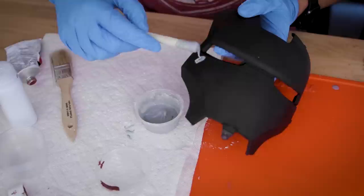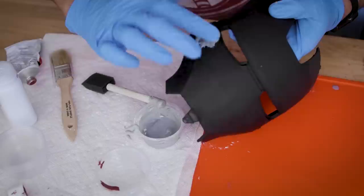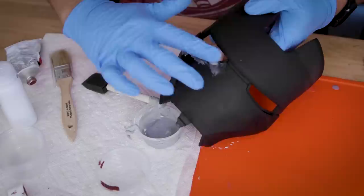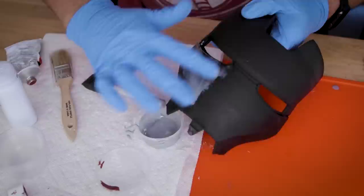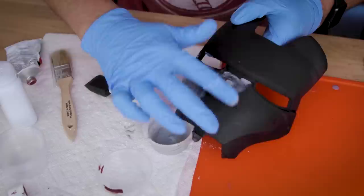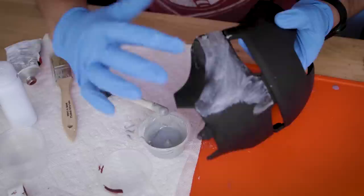Basically I'm just trying to fill the void with resin and then use the UV light to cure it. So here I should be able to just use my finger as well, and I can run it across that seam that I had on the print. This is almost just like working with Bondo spot putty — see how thick that is? There's no way I'd normally be able to do that with just resin. So here I'm going to smooth this on with my finger. In fact, I could probably go over the entire face plate. In theory, you could rub it all over your prints this way as well.